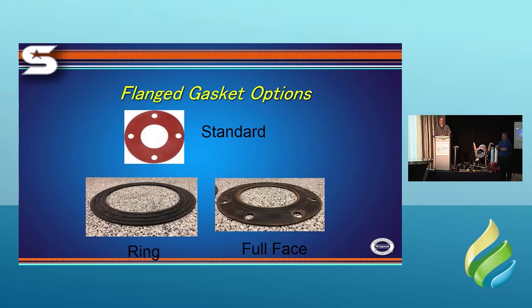The material could always handle 350 or higher PSI with safety factor. The bottom two gaskets in that slide, you can see there's little ridges on them or a bulbous area on them. That allows for more compression to happen. That's how you get your higher pressure rating for your gaskets there. So just because it has 250 PSI on a flange fitting, if you use the right gasket, you get 350 PSI.